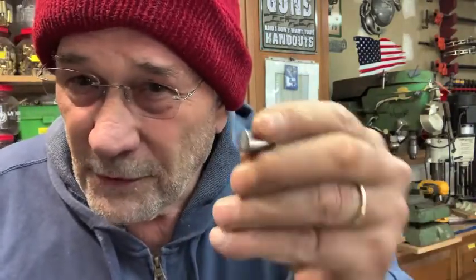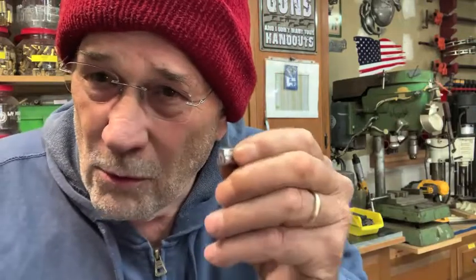But I'll always be testing this diameter no matter what cast I'm pouring or casting. You know what I'm saying? This will always be the test subject of the bullet metal that I'm using. So what Harry was saying is I can set that press so that when I make a full stroke and just let her lock down, cammed over, the top of that die will be flush. And then all I got to do is look up there at the clock and watch the 30 seconds pass, take it out, and go to measuring with the pocket scope.